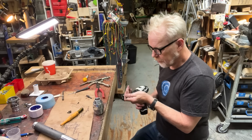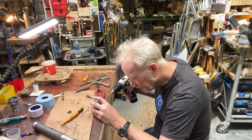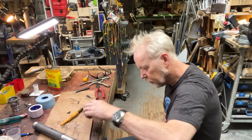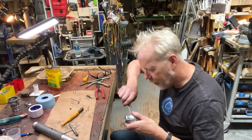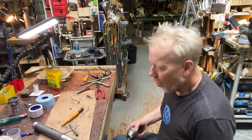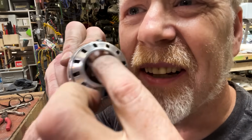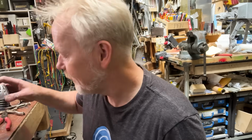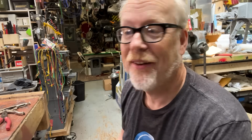So here's how we're going to do this. We're going to make the whole center using the through bit. Oh, great. That was the thing. Now I have, on the opposite of the front, two screws holding in a nice big chunk of aluminum. Now I'm going to drill a center hole in that, and then I'm going to cut away everything I don't need besides that center hole. Everything. I never don't find screwing these together super satisfying.